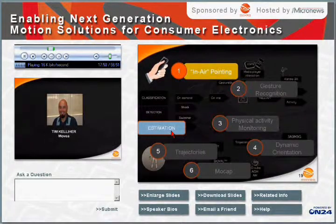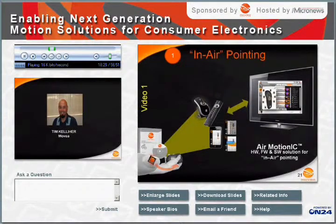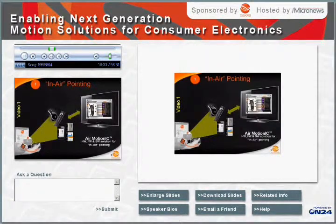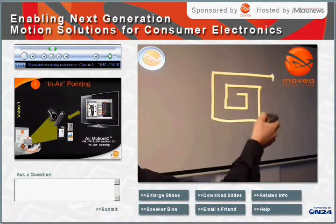The first high-level feature I'd like to cover is in-air pointing. To achieve in-air pointing, a two-axis gyroscope is employed in conjunction with an estimation algorithm that converts the rotational motion of the pointing device to a delta-x, delta-y translational motion of the cursor on the screen. A three-axis accelerometer can also be utilized to sense which way is down, allowing for compensation of any roll angle of the pointing device, ensuring that the cursor always moves up when the device is moved up. In this video clip, the actor uses an air-mouse pointing device to draw a series of patterns on the screen — note the fluidity and responsiveness.